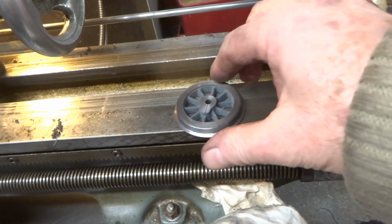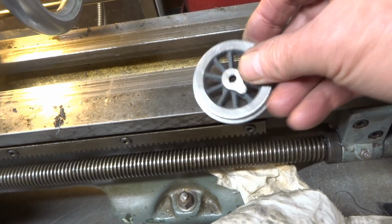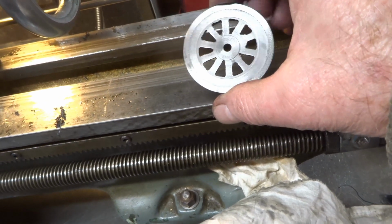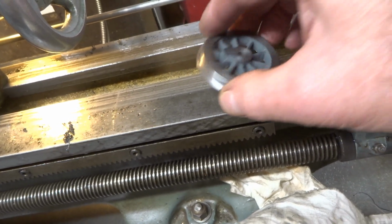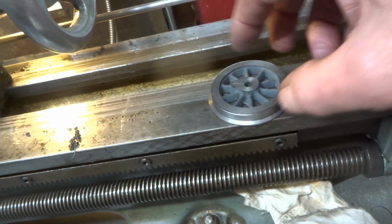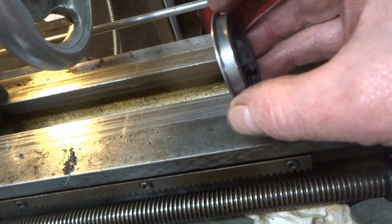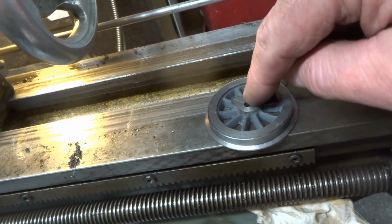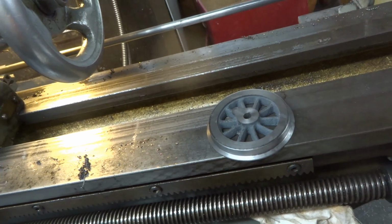Right, I've almost finished turning the first wheel as a tester. The tyres Loctited on. The back is faced and turned. It's just slightly over width. What needs to happen is to mount it on an arbor and 4-jaw. Just true it all up. And ultimately get all the tyres to exactly the same diameter within a thou or so, and then the correct centre, drill and tap for the crank pin, and that'll be them done.